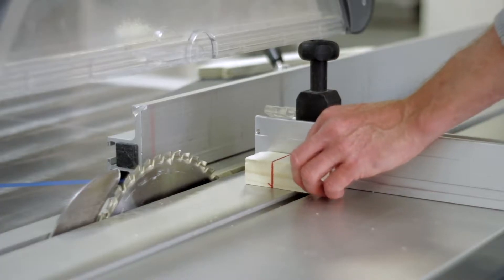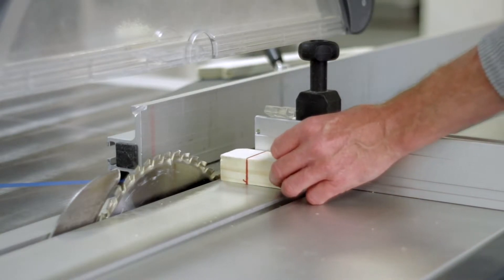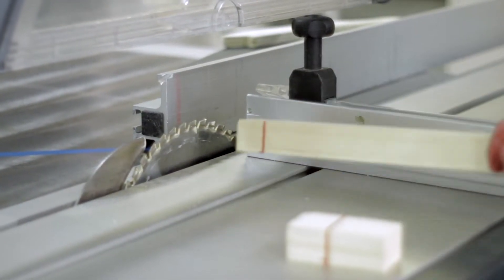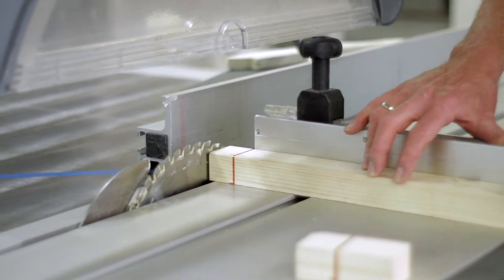The table saw can be a very dangerous machine. It has several safety parts, but hopefully your brain will be the best one. Try to think logically. You can't cut any fingers off when they are not near the blade, and therefore it's not logical to cut small pieces out of small pieces of wood — as you can see, my hands are quite near to the blade in that case. Take longer pieces instead, and it already feels much safer, as my hands are way further away.